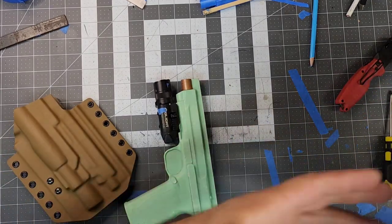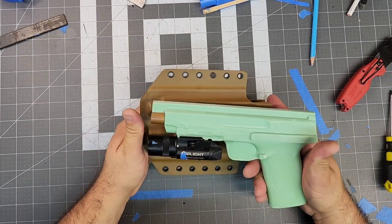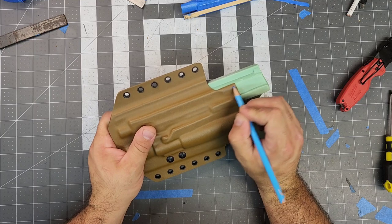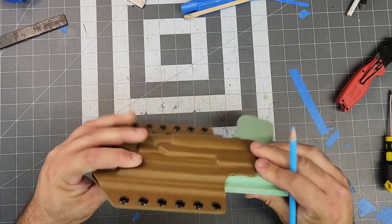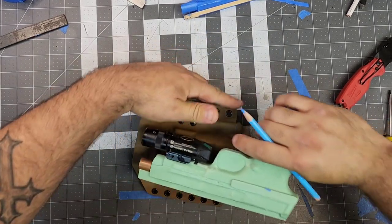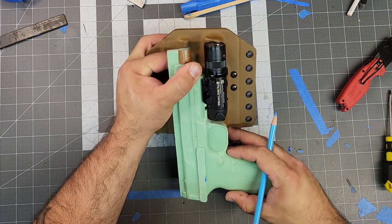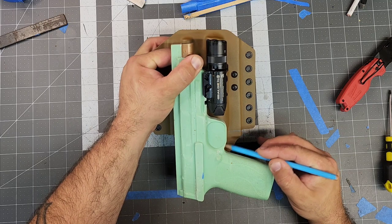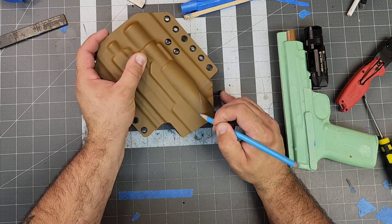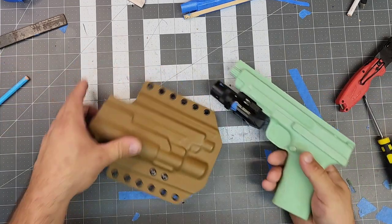So the second one's out of the press. Here it is right here. Black on back, got it on the front. So we're going to work on that a little bit after. But I wanted to get this one going, so we need to figure out where it's going to sit. I'm going to have to come a little lower on this side right here. No big deal on that body line. That's going to have to come up. So this is going to be — I'm going to do it right there. I'm going to cut it right here. And I'm just going to cut on the outside of the line and work my way in to make sure I don't overcut. Because I can always take Kydex off, but I can never add it. So I'll go to the bandsaw and do this real quick.